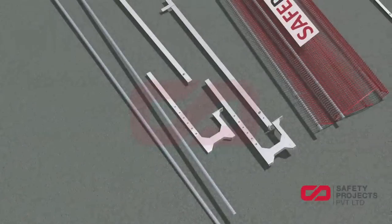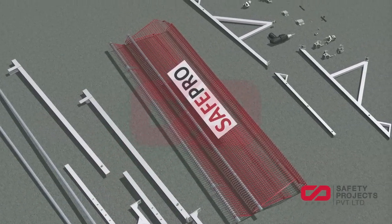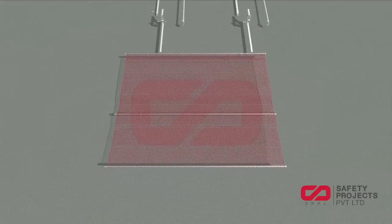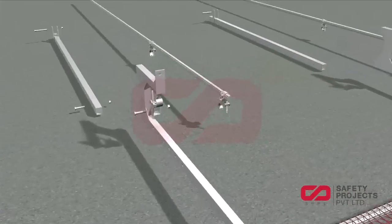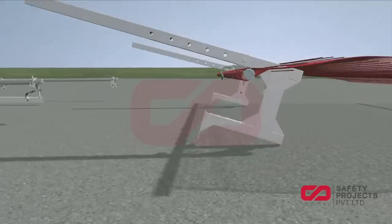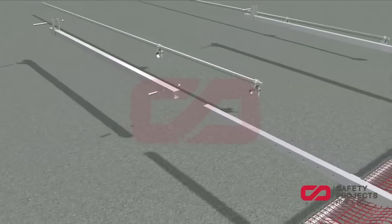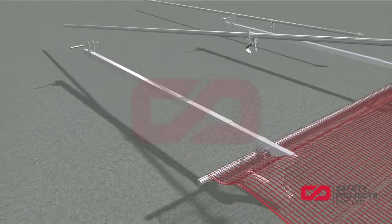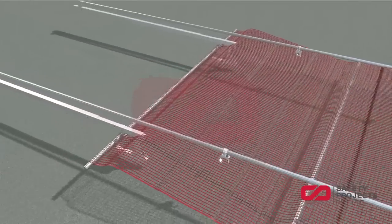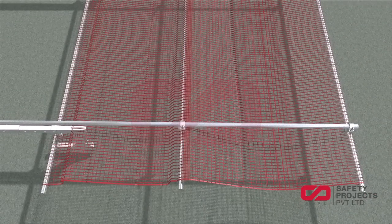The SafePro safety net fan system consists of several parts and accessories that are mobilized in an unassembled form. The net panels are delivered as an assembly with hollow section tubes inserted as shown. The assembling of the system is very simple. Secure the slab attachment on the net frame and tighten with the couplers provided inside. The vertical support extension should be attached to the slab attachment. Next, place the inclined hollow section on the net assembly with one end fixed on the vertical support's bottom and the other on top of the two hollow sections on the top of the frame with the use of fixed couplers.